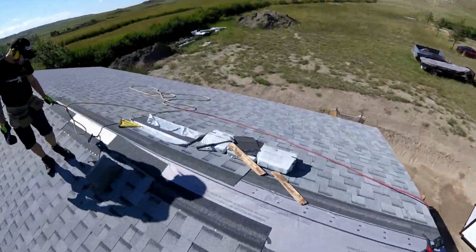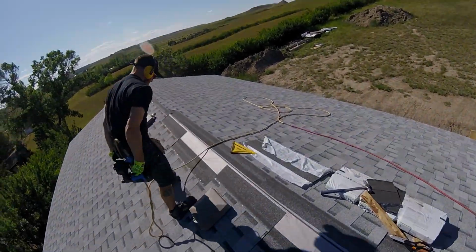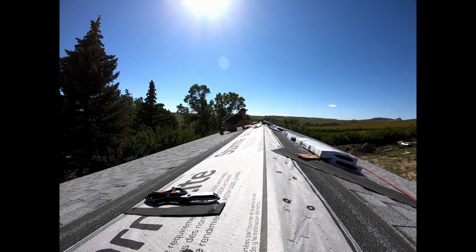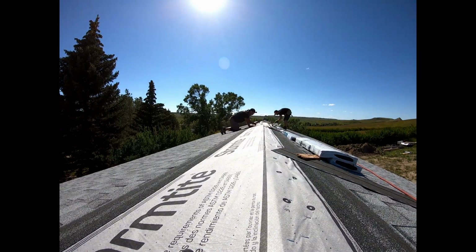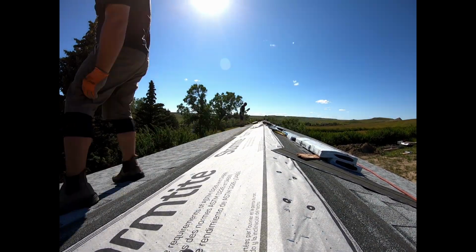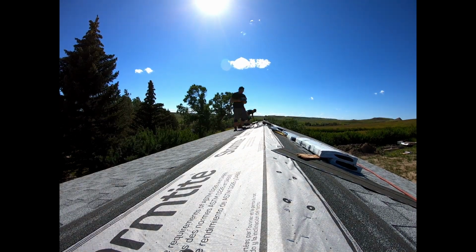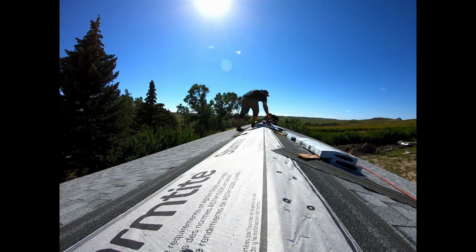The reason why we're placing these roof vents so close to the peak like this is because on the rake ends of the wall, they're vented soffits. You'll see us putting those in the next videos. So the vented soffits take air into the attic, and these roof vents exhaust that air from the attic. Fresh air is drawn in from the rake ends and exhausted out the roof vents.